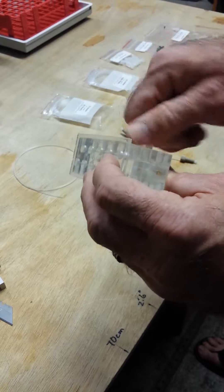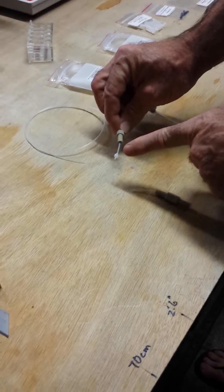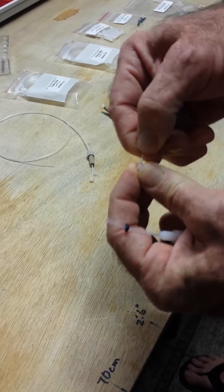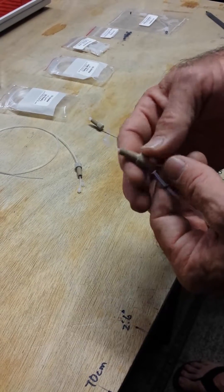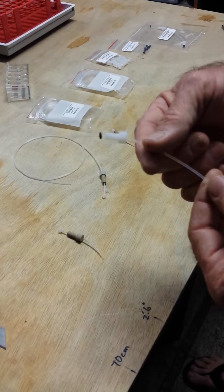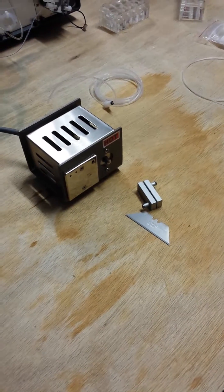Overall it's very easy. Don't forget that nuts and ferrules are single-use because they're designed to seal by tightening down, and once they're tightened they can never really be tightened again. You can see how tight that is — so they're expensive, several dollars each, and this fitting is not cheap either. Once you have flanged fittings you can reuse them over and over; all you have to do is replace the tubing, making just one investment with a flanging device, which we'll go over in the next video.